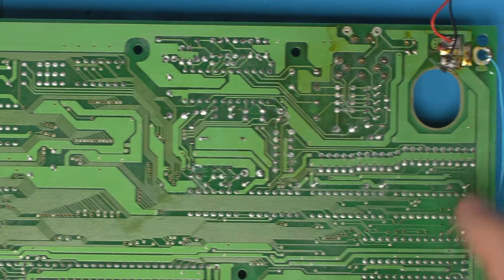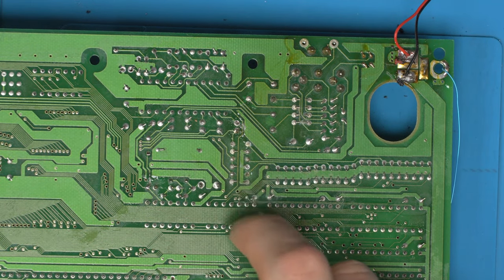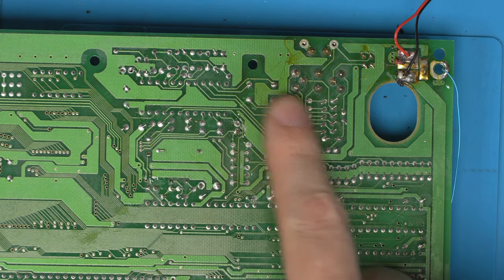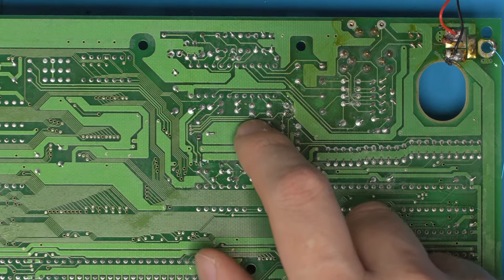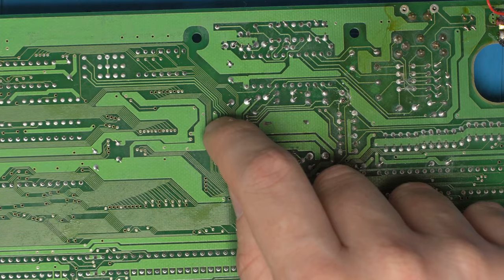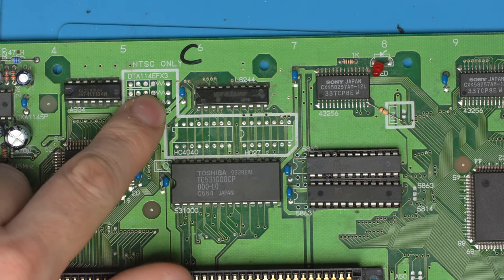So the AV port's here. The red, green, and blue inputs here go from the resistor divider network up to here, out, and it's all clean here. The noise comes from these lines here. Well, what are these lines doing? They go along here, past the clock rail, over here, trace another 5 clock rails, pick up tons of noise, go to here, flip the board over, and what do we have?